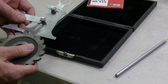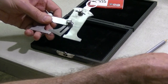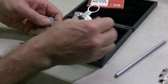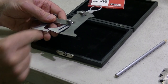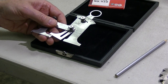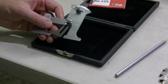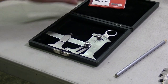You read the angle off the scale at the top. It's fully adjustable for the diameter of the cutter and for the height of the tooth — just spin it around and read off. This is just under 14 degrees clearance. It can even be brought down fine enough to read the primary clearance on the end of end mills. Quite a worthwhile piece of kit, and I'll be using it a fair bit to check the accuracy of my work.